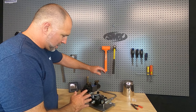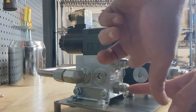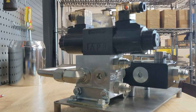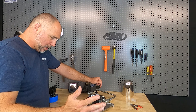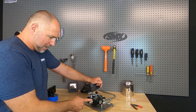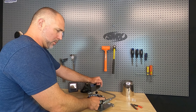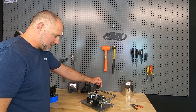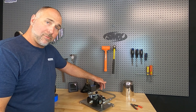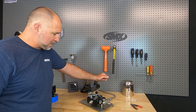The system is designed to just tee right in, just like a traditional autopilot system. You're going to tee into the lines between the helm and the rudder, and you'll tee these in. The only additional connections you would have to make is you have to grab the high pressure line and the return back to tank. So you have to put this in line on the return back to tank. Tim's going to go over all that in the later part of the video, but we have these for sale on our website.